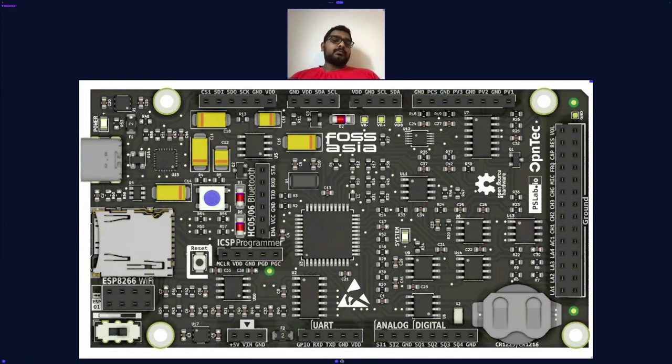The ESP-01 is the same chip but comes as a separate module with header pins, so users can simply plug it in without having to solder anything. We also added an SPI interface to the PS Lab V5 design, and the I²C connectors were made compatible with QWIIC sockets. QWIIC is becoming more of a standard in I²C connectors because many vendors keep developing different arrangements with the four pins — ground, VDD, SDA, and SCL. We wanted to be compatible with commodity devices and sensors as much as possible while supporting the advanced features PS Lab offers.